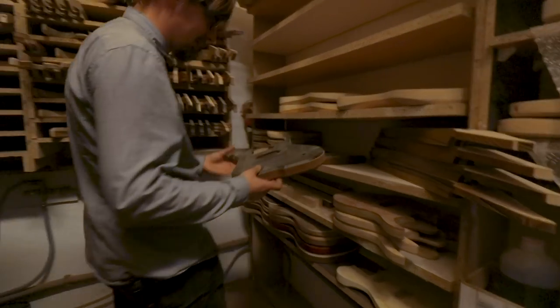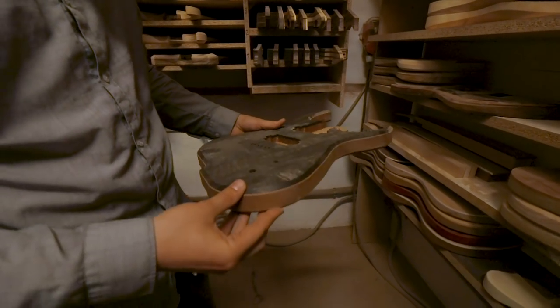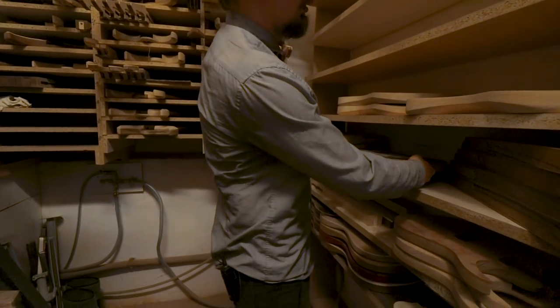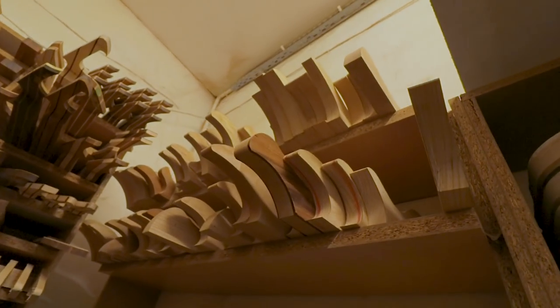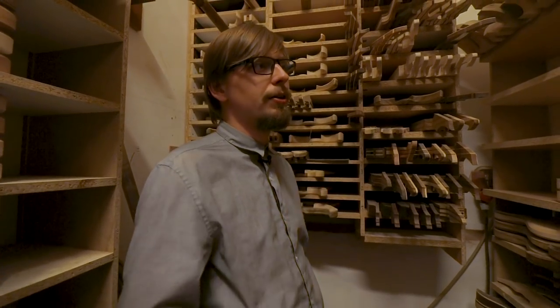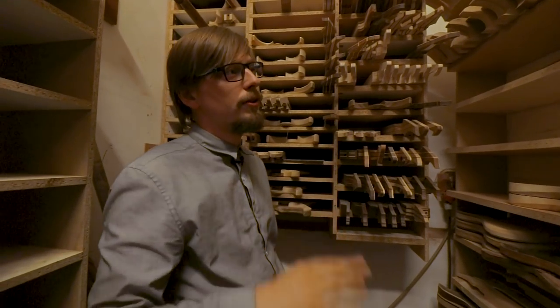This one is actually a really unusual combination for us because it's a really heavy body — really stiff and rigid because of the layer glued between the top and the body. African mahogany with redwood top and maple layer between them. Most of our guitars are built with a different philosophy — swamp ash bodies, about 70% of what we do are ash bodies with burl tops combined with rigid heavy necks. Sometimes you just want to experiment. We also have some really old experimental stuff here — this is a discontinued model, the Chiroptera, with a thick full ebony top with African mahogany in the back. Here you can see neck-through side panels ready for clamping — this is the final step after shaping the neck, shaping the fretboard surface, giving the radius, and pushing the frets in.